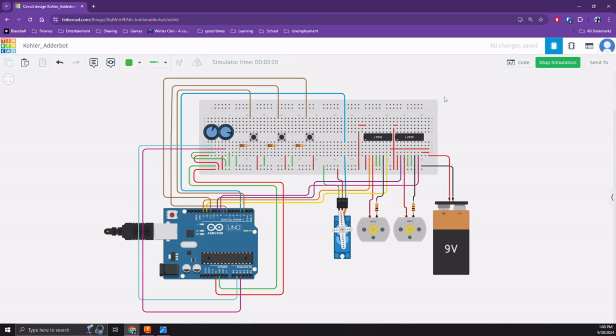Both the liquid run and solid run functions output their potentiometer readings to the serial bus for potential troubleshooting, and it is noted that the potentiometer reading set points use a range of 20 ohms above and below the index set points to allow for some amount of drift inside the potentiometer.